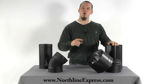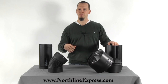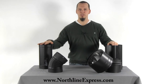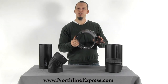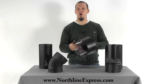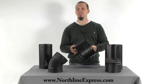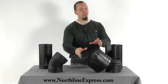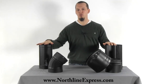Another thing to keep in mind is that double wall stove pipe is necessary for mobile home installations. Single wall stove pipe is considerably cheaper than double wall stove pipe, so that's one thing to consider. Double wall stove pipe has a stainless steel inner wall so it heats up faster and tends to stay hotter longer, which will improve your draft and help speed up the time it takes to get that draft established. The downside to double wall pipe is that it's insulated better, so it doesn't emit or radiate as much heat into the room as a single wall stove pipe would.